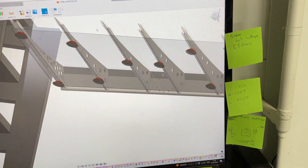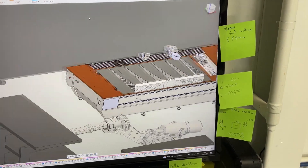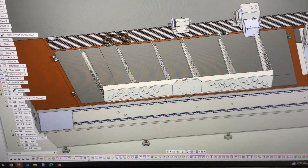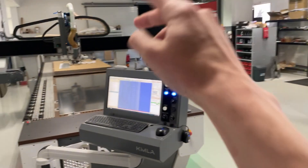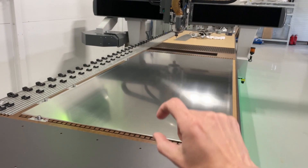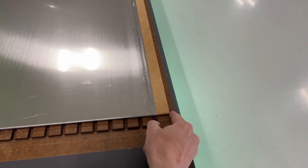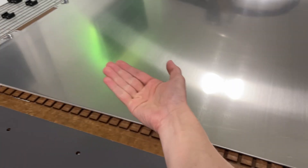I got the 3D models from the distributor — it's gonna be quite a sizable thing, a bit hard to control, but anyway, it's gonna be big. This is the 10 millimeter cast aluminum sheet that I'm gonna be putting on the vacuum table and cutting a new vacuum grid into, because it's gonna be pretty much a spacer. When I order the HDF I order it a bit wider so it's easy for the tool to come in underneath and lift it all.